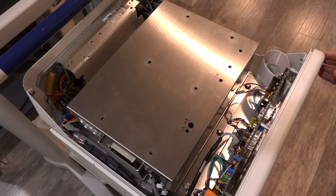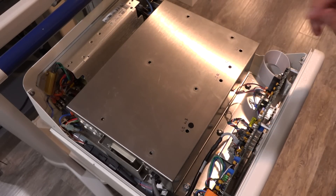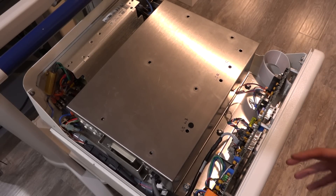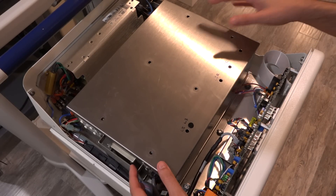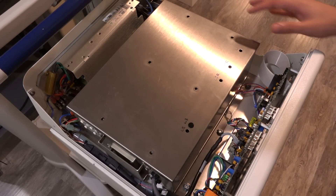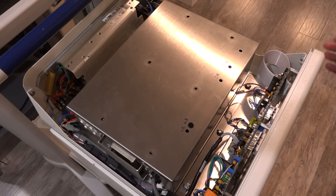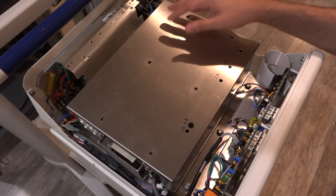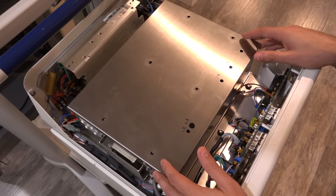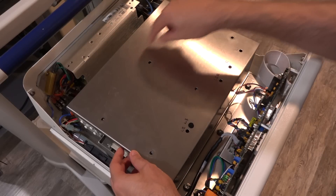We need to understand how our machine performs focusing. With the top of the unit removed, we have access to the X-ray controller, the main power supply, the X-ray controller board, and the X-ray power supply and tube. There's one board that interfaces with the front panel — all the numbers and keypads — and probably contains the main processor. To control the X-ray itself you really only need an RS-232 port at the back. The sensor is entirely independent, sitting at the bottom with a USB port.